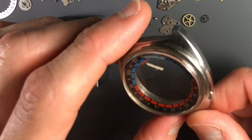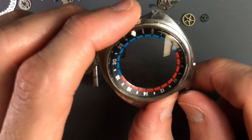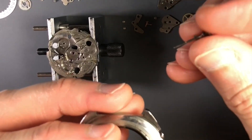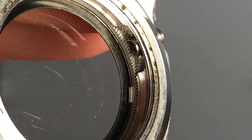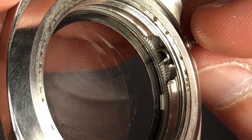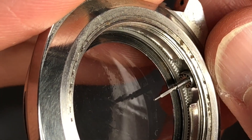Lastly, let's take a look at the case components. I'd like to take a closer look at the internal bezel — I'll show you how this one stacks up against a later version with the one-piece. As I mentioned, the teeth on the gear on the stem is going to interlock. Let's get a closer look and I'll show you exactly how that bezel works. You can see how the teeth line up just above the inside part of the crown tube there, and as the stem comes through, that gear is going to align with those teeth. And there's how the bezel rotation works.